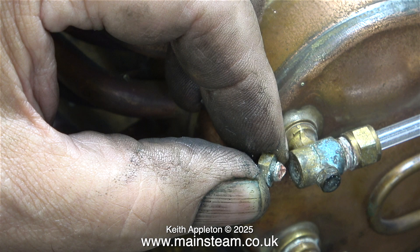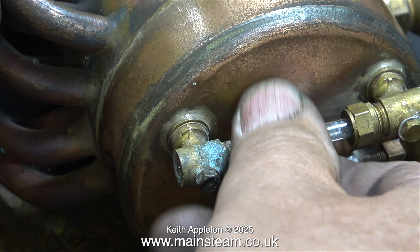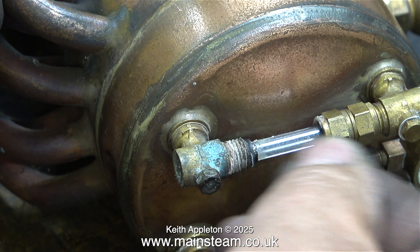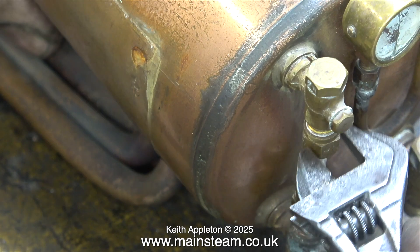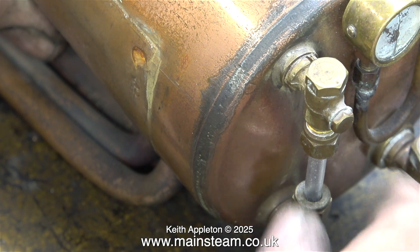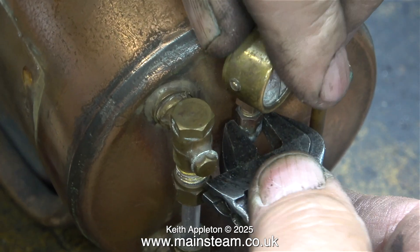Dismantling the larger Stuart 504 boiler — this job did not start off well. The bottom cap of the lower water gauge was non-existent; it just fell apart. This is actually worse by the look of it than the 501 boilers. These three steam plants are quite old, and looking at the state of the boiler fittings does bear this out. This is the worst limescale contamination and cathodic corrosion I think I've ever seen on a model boiler.